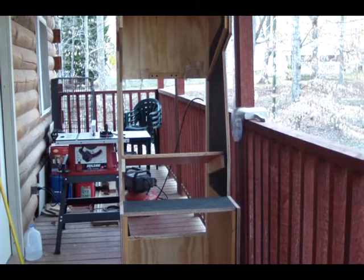Hey guys, we're just doing a little sanding on the main cabinet — got it out on the porch. We're going to sand off any splinters just to make it a little easier to paint. We're not going for a super smooth finish; it's all just going to be on the inside. The old black paint on the inside we're not going to sand completely off — just make sure there's no line where it stopped or where there was wood glue from previous cleats for the monitor support. Then we'll blow it all out with the air hose and come back and put some plugs in those screw holes. We've decided we're not going to use primer because the paint already has primer in it — I can get about 10 bucks back for the primer. We'll just use the paint and maybe do two coats.